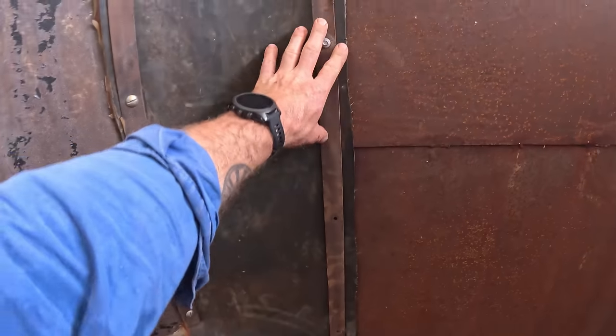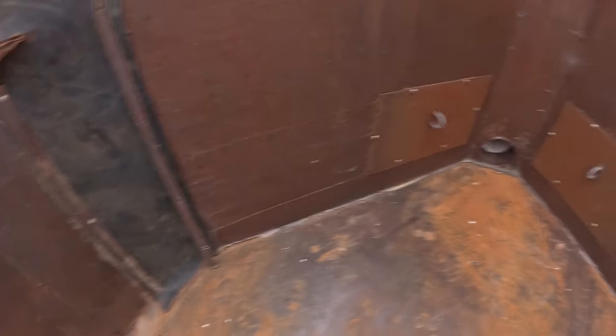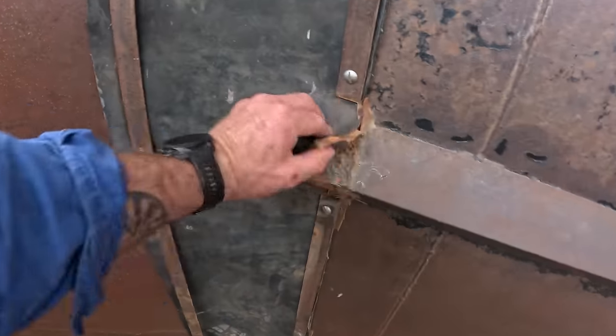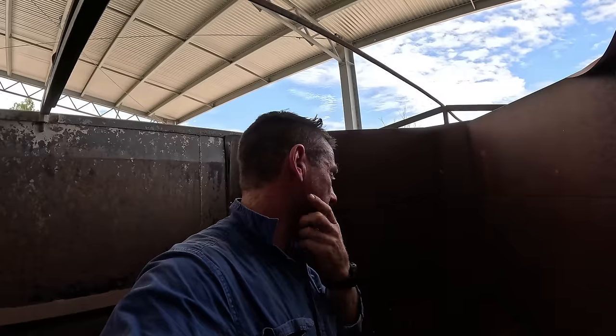We lifted this division in — had to bring it through the back door yesterday. I'm just going to finish off screwing these straps on and then run a bit of silastic around the bottom and under there, just to seal it up, because we don't want seed mixing with the fertiliser. Obviously the fertiliser we don't clean out till the end of the harvest-sowing, but the seed — when we've got different varieties of wheat and then the barley — we don't want to mix those up.